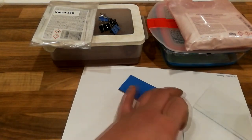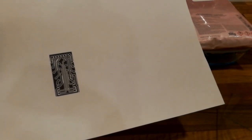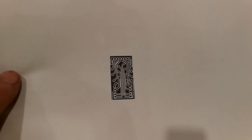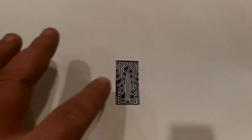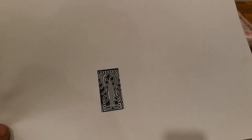You will need your circuit template on a piece of paper. It should be printed in the right scale. This is what people usually don't tell you before you've tried a couple of times and wonder what's wrong. You have to check your printing settings and verify scale with some pins, like your Arduino pins, or measure it with calipers. This is plain old normal printing paper.